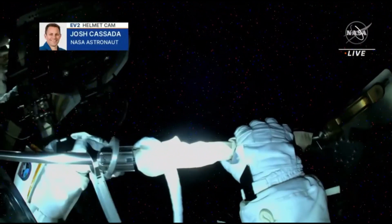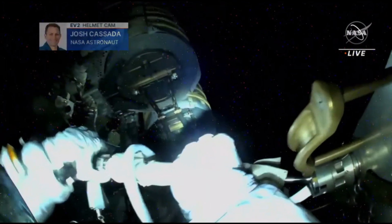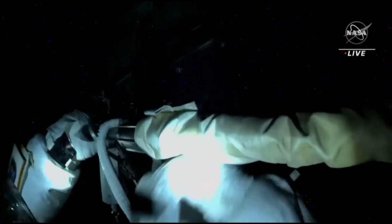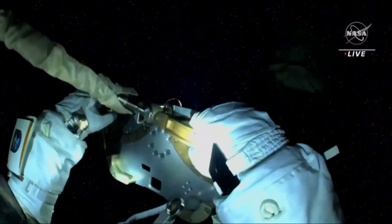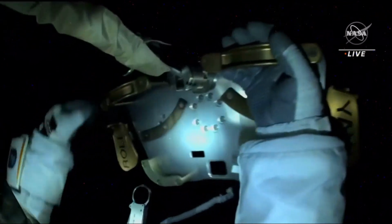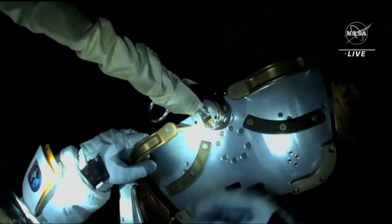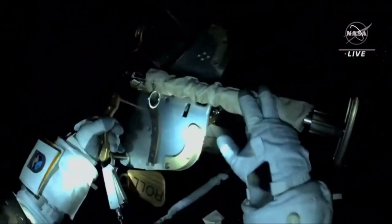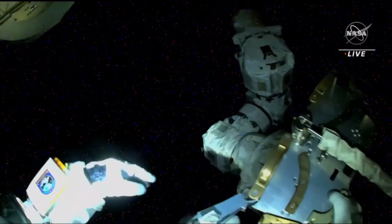Yes, we do. I'd like you to get it stowed in low profile. Special tool called the AMS knob. It's essentially a screwdriver that you can operate by holding it in the palm of your hand. And this way we're going to make sure we're not imparting too much torque on the final install of these bolts. And these hinge bolts are what's going to securely hold the array in place once it's unfolded.